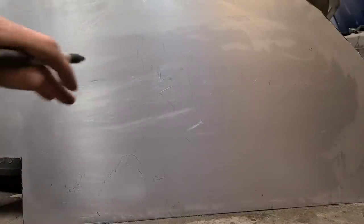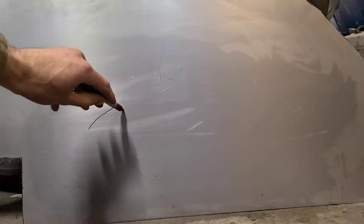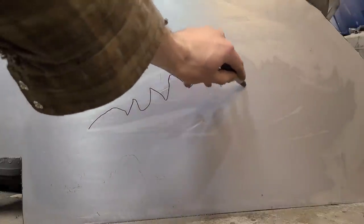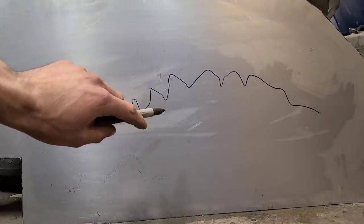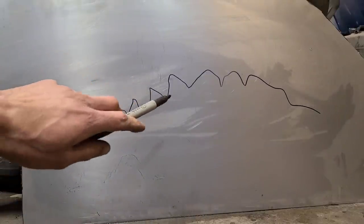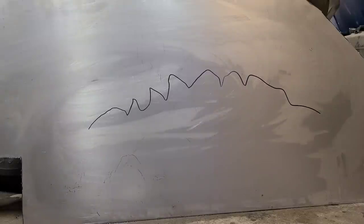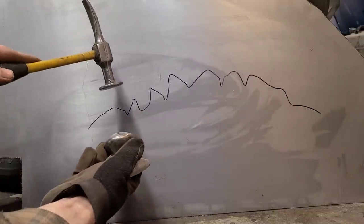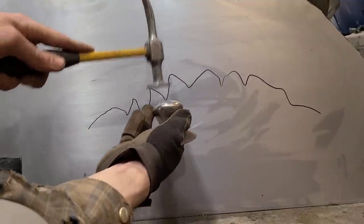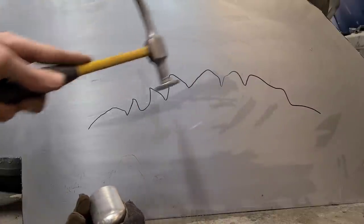So now in the case of this fender, what's happened is you get a nice round panel, but somebody's already beat it out with an axe for us, which really didn't help anything at all. But we've got such a lumpy area that we're trying to straighten here. So I'm doing a combination of hammer on dolly and off dolly, and I'm just going across. I'm working a large area, basically hammering as I go and pushing up from the bottom, just trying to rearrange this the best that I can.